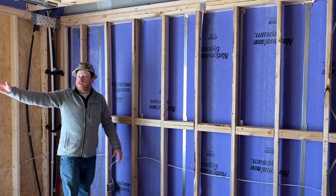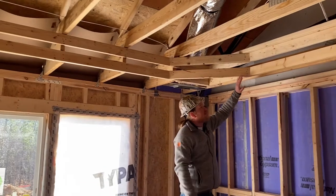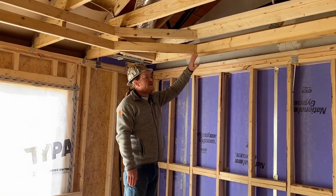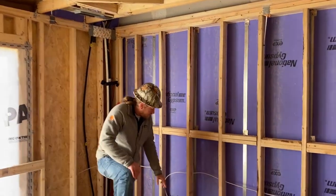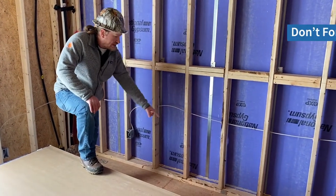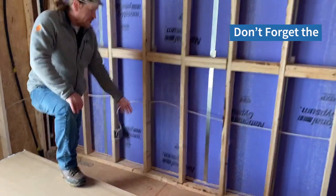This bedroom also happens to be a tray ceiling. What's important is that we get these perimeter walls — air sealing the tray is not going to have as much value as air sealing the actual wall tops, because it's not going to leak down into the actual wall systems. The other detail we want to address, to keep as much air out of the living space as we can, is to make sure that we seal our bottom plates. On the first floor it was done with a sill seal product on the concrete; up here on the second floor they've run a bead of foam.